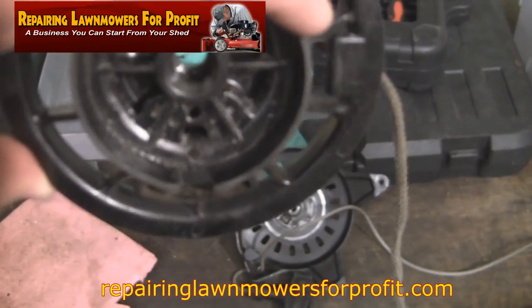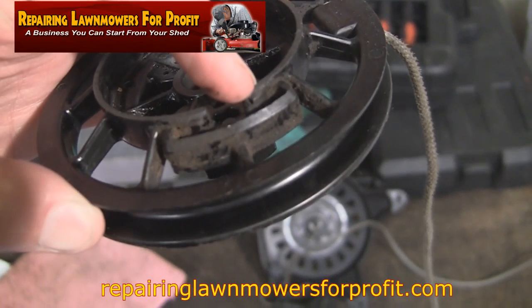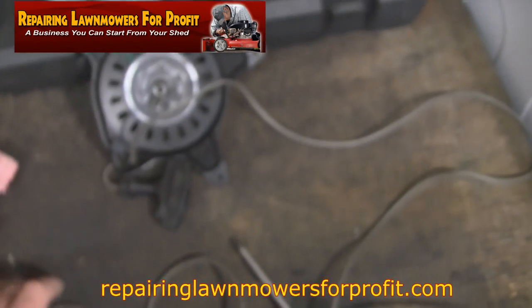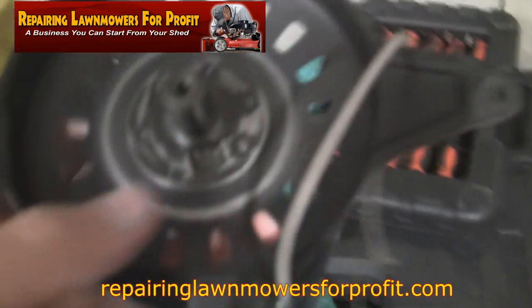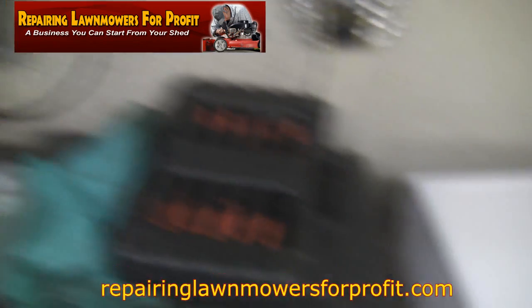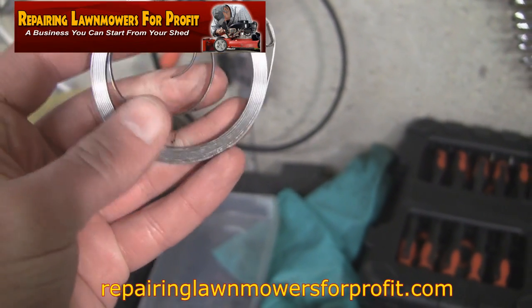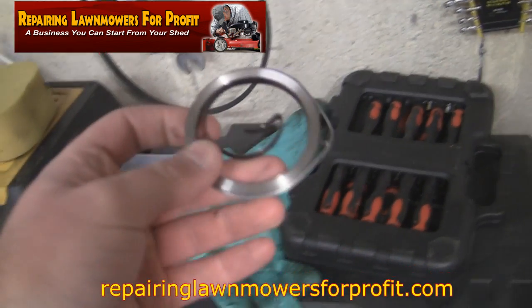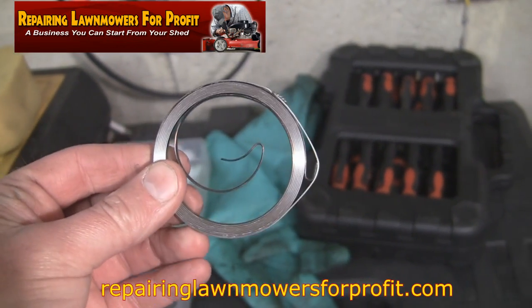This plastic recoil has some little clips — it just pushes on there. I'm going to push this on first of all, try and get this on nice and neat. I'm going to try and sit it in the centre and hope that when I put this part on, I can push it all back together and it somehow automatically clips back into this metal housing. The only reason the other one failed is this part of the spring — it actually snapped. I was trying to heat it up and bend it back around the other way to create an end, and it was just virtually impossible. As much as I heated it up and bent it, it still snapped. You're working against the spring and you'd still need to rewind it.